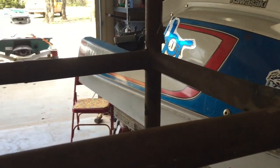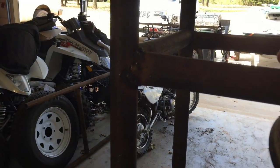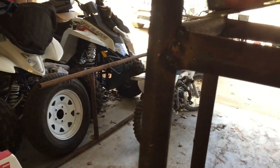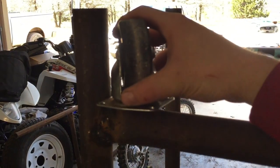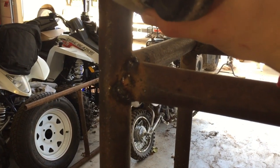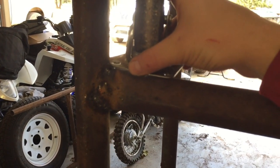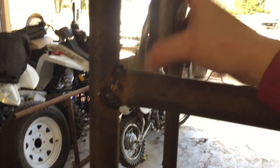Before we actually make the measurements to get these top parts off, I actually need to get the wheels on just to get a better estimate. For the wheels, I'm thinking of chopping all four of these off — I should have just done it in the first place — and then setting the wheels like this and welding them on. I know this stuff is super thin, but I should be able to weld it on using a little less power and maybe some smaller gauge sticks.